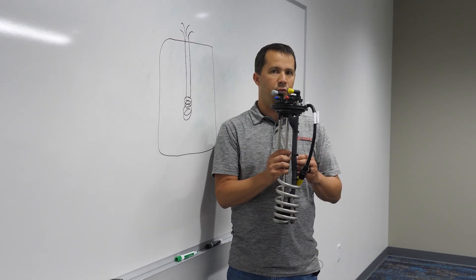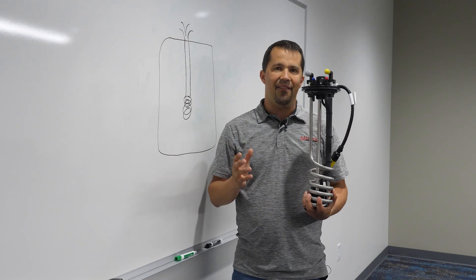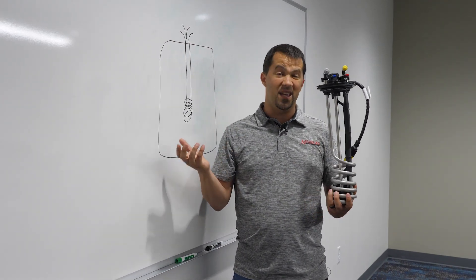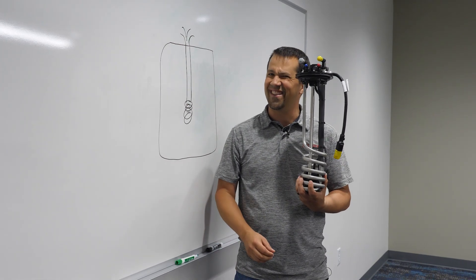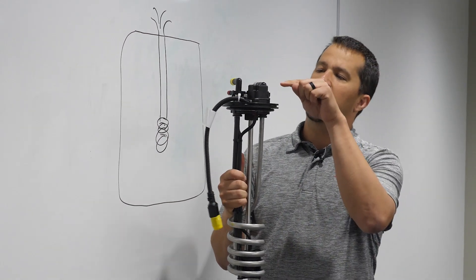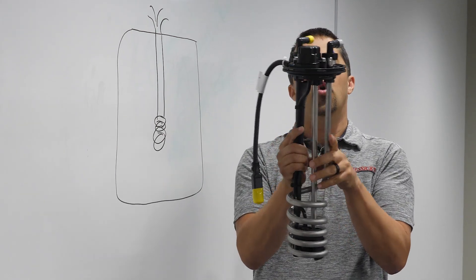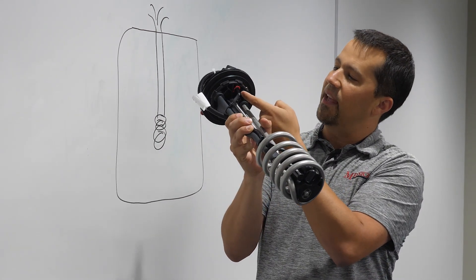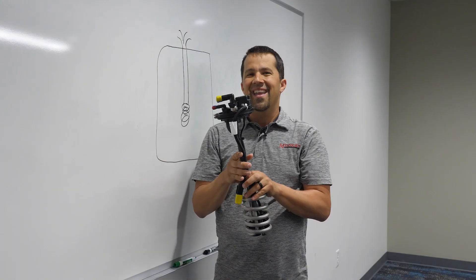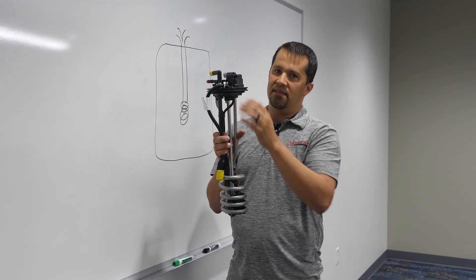There are a couple of different ways that companies have gone through and addressed and improved these parts. I should be clear that this isn't like a Kubota problem — every machine that has a DEF system is going to have these functions, and by and large many of these companies are probably using very similar parts or even parts from the same suppliers, because a lot of this stuff comes out of the automotive industry. There are early failure points that we saw on these that have now been fixed. Right up here on the very top is this little box — that's where the actual DEF quality sensor is. There's an electronic circuit board inside of this. Early on, ammonia gas was getting up through the inside of this thing into the top, corroding the circuit boards, and then these quality sensors would stop functioning. As we learned more about that, they've changed the way that they seal these things up so that ammonia gas can't get from the tank up into the sensor as easily.